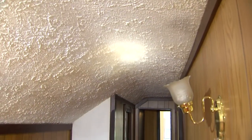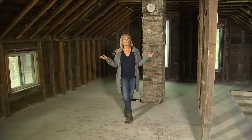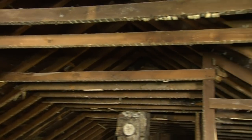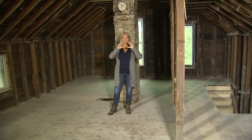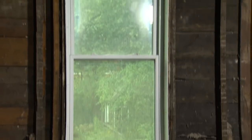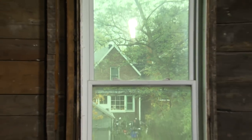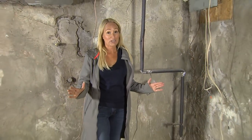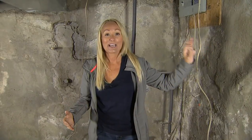When I first walked through the upstairs of this house I noticed the hallway ceilings were lower than in the bedrooms. By taking everything down I could see what I was dealing with: these collar ties do not extend all the way from one rafter to the other, which is a structural concern — those collar ties are there to hold your roof together. While you're at it, look at all the studs for damage. I also have high windows up here and a first-story addition at the back of the house — my plan is to create a flat roof, swap out that window for a door, and have a nice deck. The basement windows along the driveway are below grade without a window well and no weeping tile system — that's water problems waiting to happen, so I'm deleting those completely.